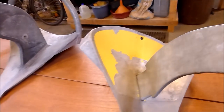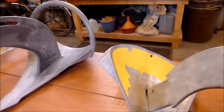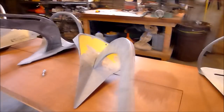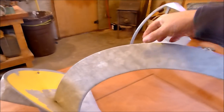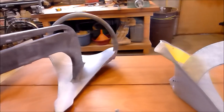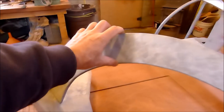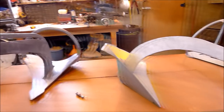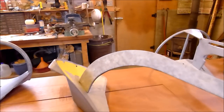The shank is also removable — it fits into a slot and is held by a bolt. For strength comparison, I measured back about 23 inches and averaged the width, coming up with a width actually wider than even the Manson, with pretty good height, though a little narrower than the Excel and the Manson. We don't know what grade of metal this is — I don't think it's the higher-strength steel some others use — but my gut feeling is it's pretty adequately strong.